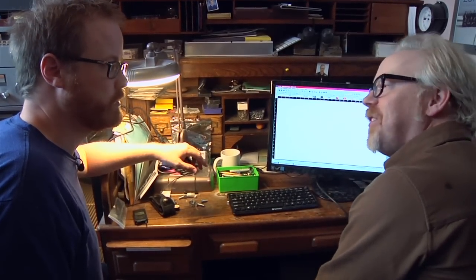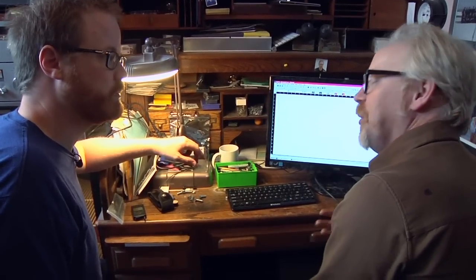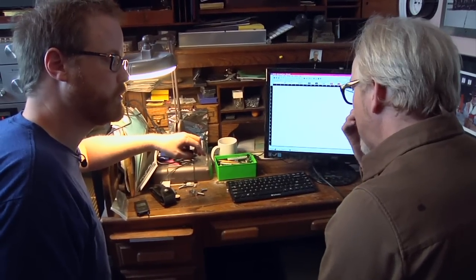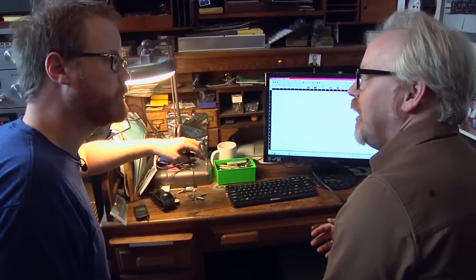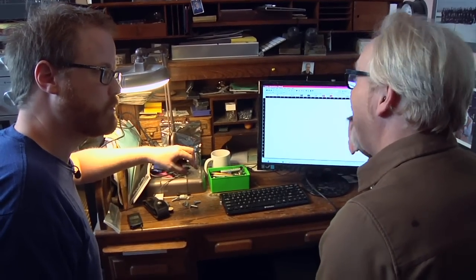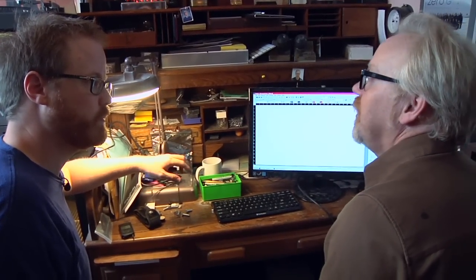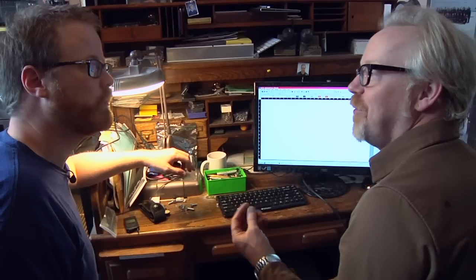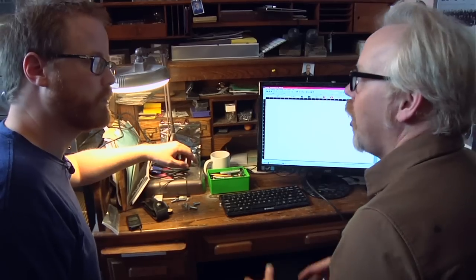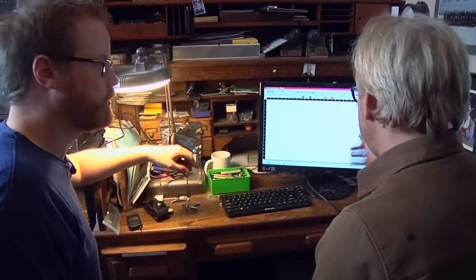Everybody who owns a laser cutter ends up building their own database of notes of what works for what materials. Cast versus extruded acrylic can have different cut speeds, especially black acrylic, which has a lot of carbon in it and requires different cutting speeds. Wood, different kinds of woods, plywoods, MDFs, they all need different settings. You learn it as you go, by trial and experience.